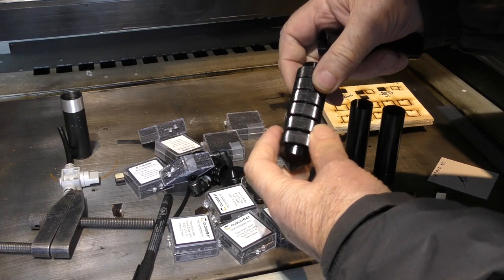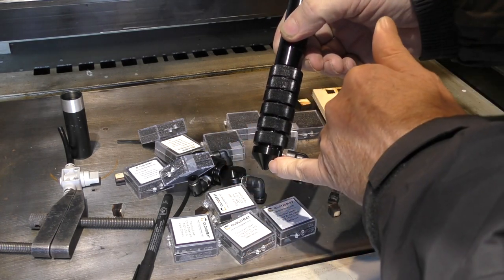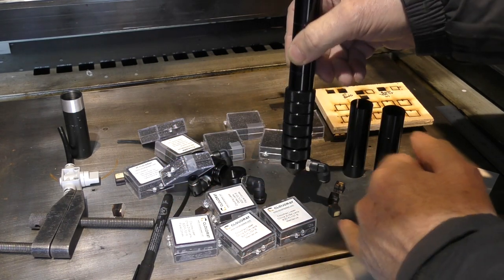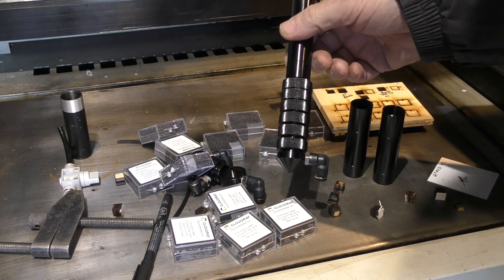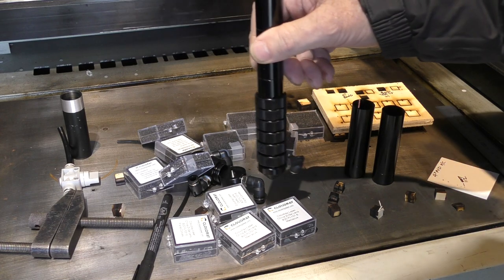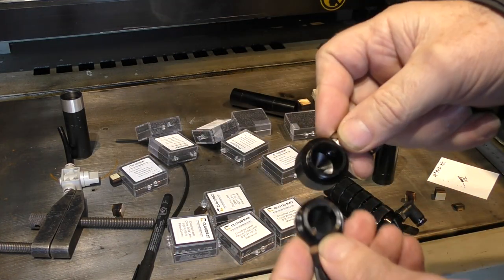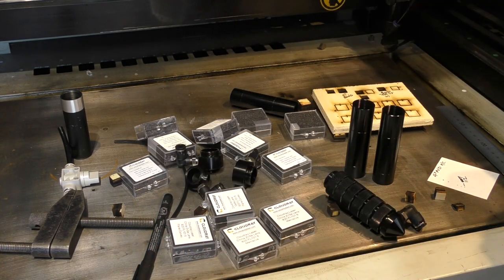One piece of very good news: I've just had a delivery of pieces from Cloudray. We've got some half-inch extension rings here, which are very useful to me because they will enable me to extend the position of the nozzle a long way down from any lens. The focal length may be so long that I want the nozzle close to the work for efficient cutting. This is only ever going to be used for cutting at slow, gentle speeds, so the long overhang is relatively unimportant. We've also got two different sorts of nozzle — one with about a two-millimeter hole and one with about a two-and-a-half millimeter hole.